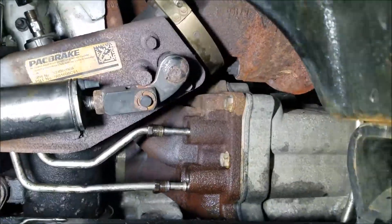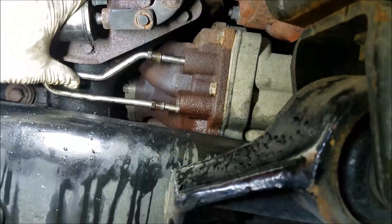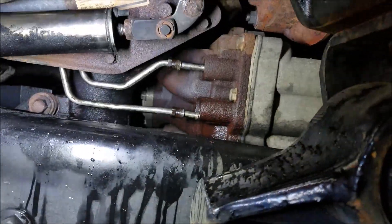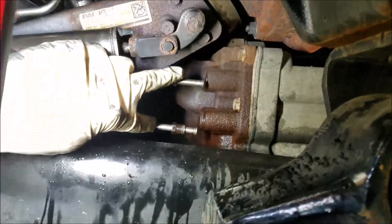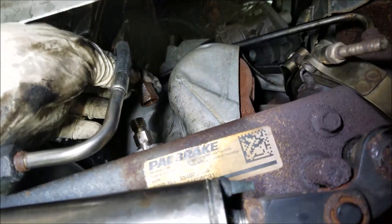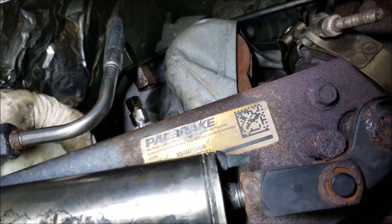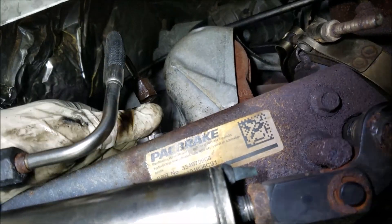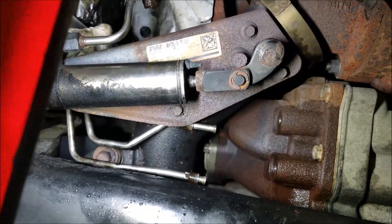What you're going to want to do is in the exhaust brake — the exhaust is right here mounted to the EGR cooler — you want to take off this aftertreatment fuel injector. These are two coolant lines; make something to catch all the coolant that comes out. Loosen the fuel line that goes into the top of it up here, and then there'll be two 10mm — I already took them out. Just lift it and slide it out of there.